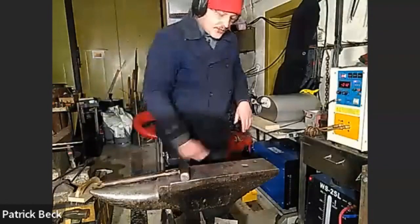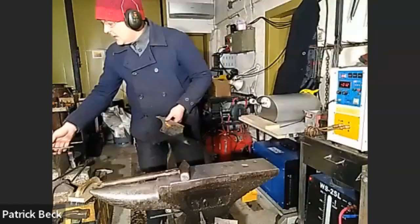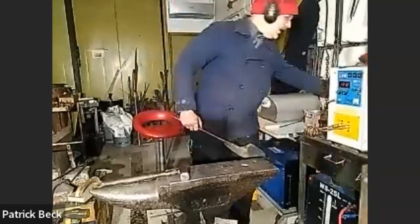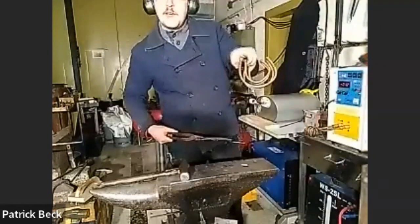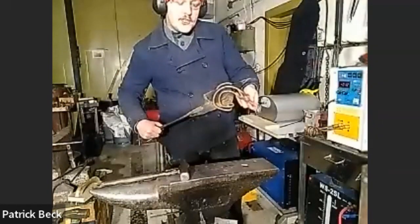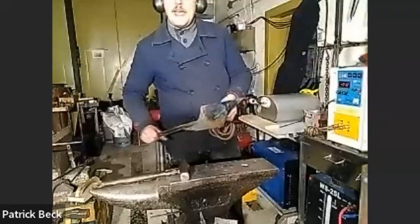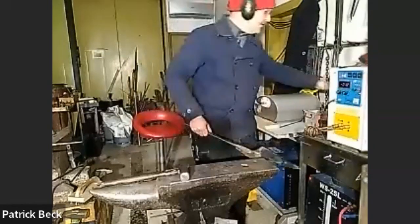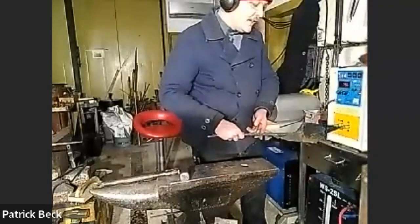There's yet another trick. If you have a big piece of sheet metal and there's no way to make a coil to heat it, you can try a large spread coil - but it's very weak and can barely do any heating. Another option is to place the material at the side of the coil and push the button. You can see it's already getting warm. This is really, really inefficient, but sometimes it can save you from making another coil when you're in a bind.